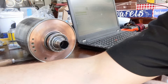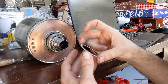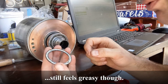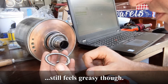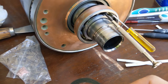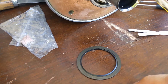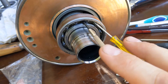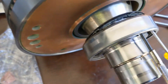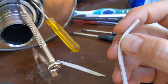On this side of the motor I also removed the seal. It looks like the grease has granulated a little bit — like little particles of sand — and it has to be cleaned and replaced. After removing the front seal we can remove the back seal. The seal is rubber on the outside and a metal sheet material on the inside. I pushed two metal screwdrivers between the balls against the metal face of the seal and pushed it out. I first tried plastic pieces but they were too flexible and broke.